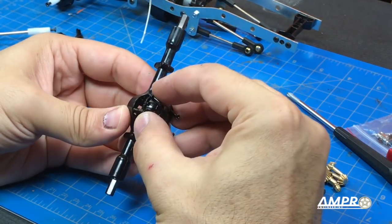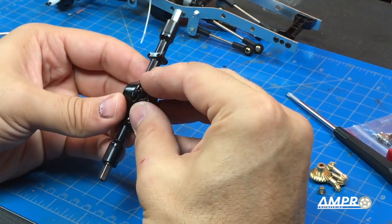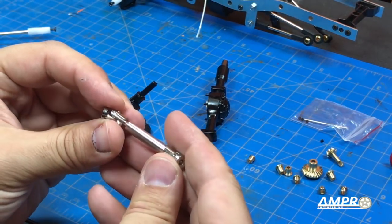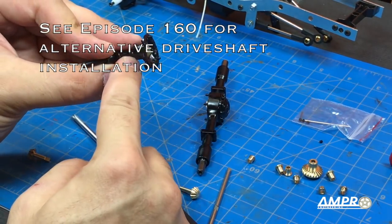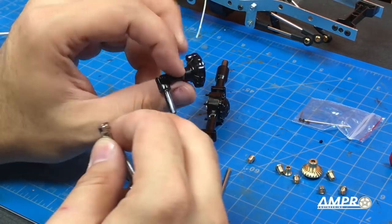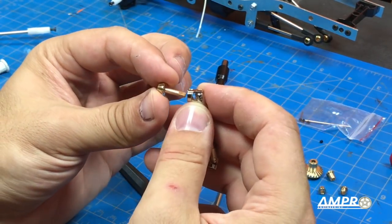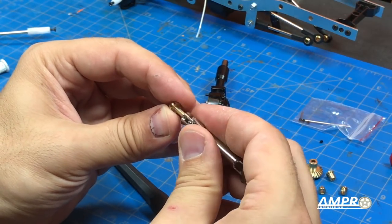I'm going to put the rear cover back on, then apply a very healthy application of anti-wear grease. We're going to have to remove the pinion and the driveshaft, and I do have a replacement driveshaft here — this is the second style I've installed. This one won't fit the shaft left over because it's been knurled, increasing the diameter, so you'll have to slowly grind down the outer diameter. I was curious to see if the brass one would fit the driveshaft, and it does — I honestly would have lost the bet there.